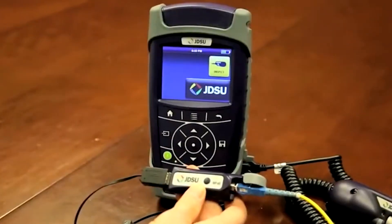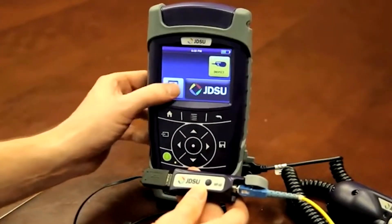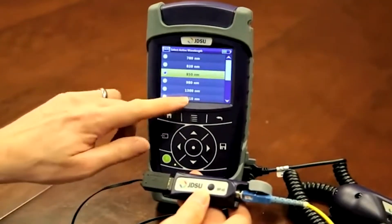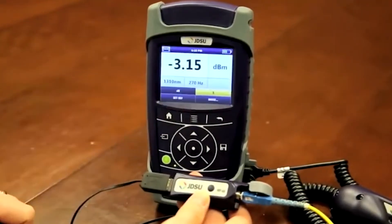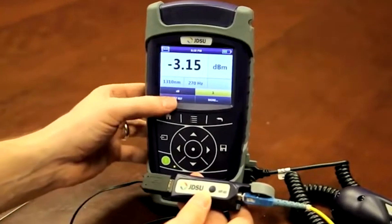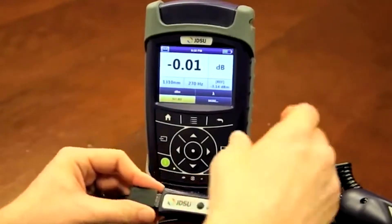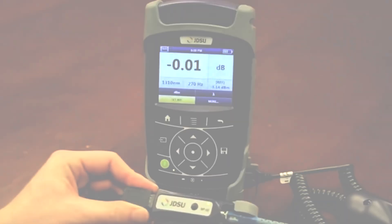In addition, you have the flexibility to plug in a USB optical power meter like the MP60 into one of the USB ports to add OPM capability. You can select multiple wavelengths, measure absolute or relative power, and store the readings individually or link the stored readings with your saved inspection results so that they are integrated together on the certification report.